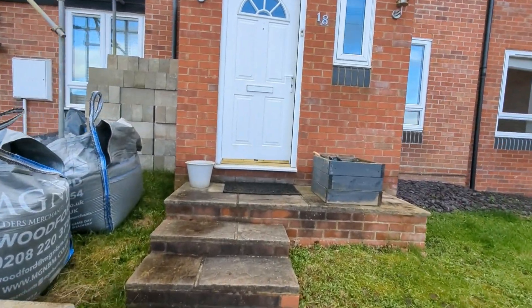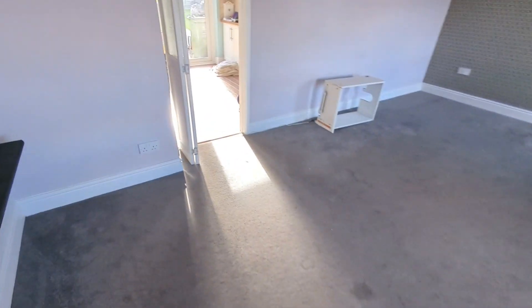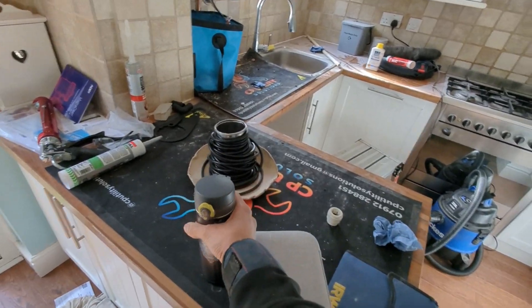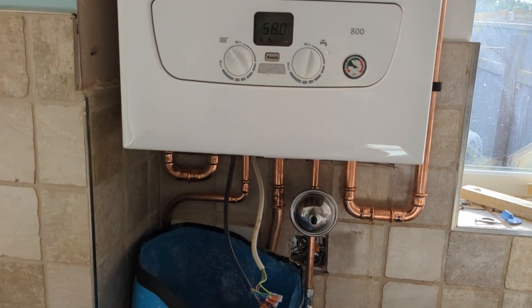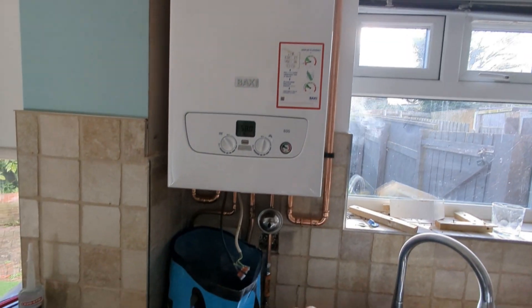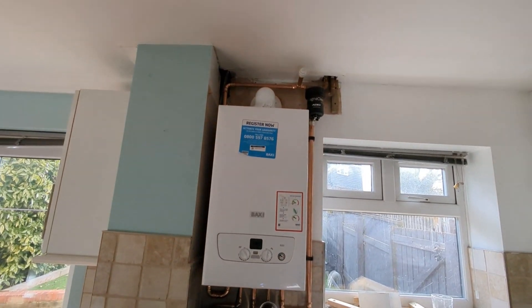We are back. Feels warm, which is always a good sign. Pressure's held - that's always a good sign. Boiler's still running, see a bit of plume coming out there - that's all good. So today we're going to be power flushing. Got my flushing points set up already. Sort out the wiring, cover that, sock it up. Got a blanking plate for that. Fit the thermostat, then commission and test and get out of here.